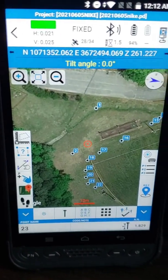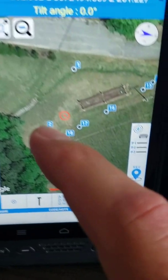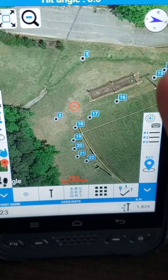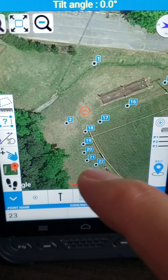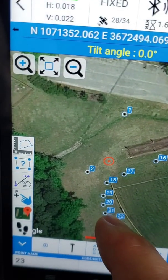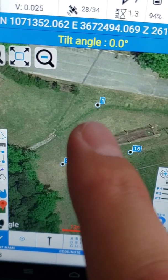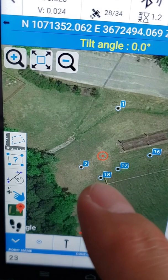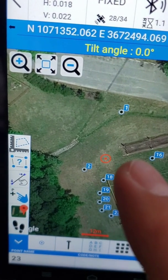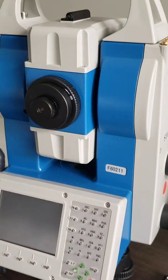What you see on this screen is where I set the total station up at point one, set my back sight at point two, and these are all the points I collected using the R80 all by myself. I walked around with the prism on the S700A on a normal survey rod, standing at each point while the R80 shoots each point. I just walk to each point and it shoots me, following me using active tracking.